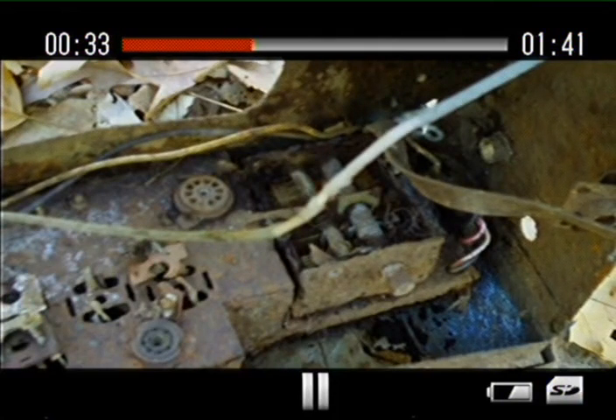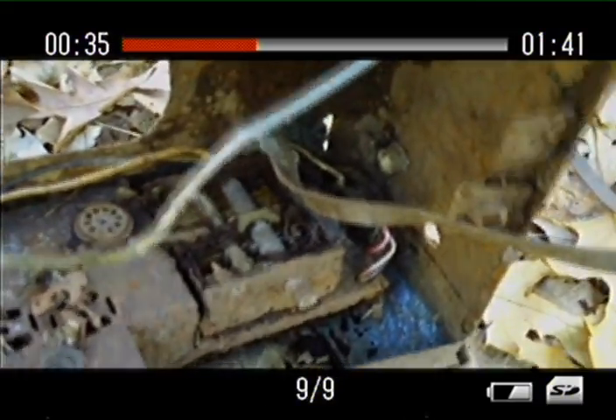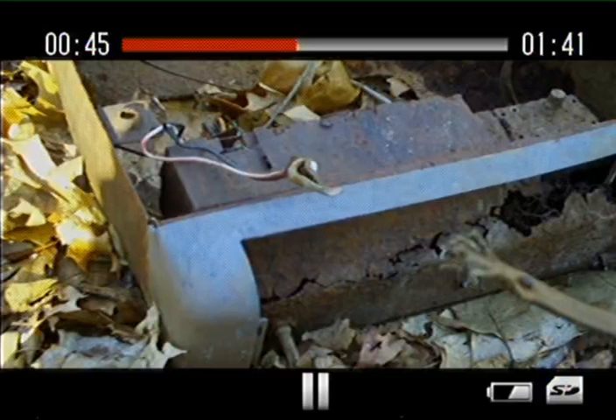The tuning capacitor, which you can barely even see there, is actually completely filled with dirt, and the dirt inside this radio was so dark it looks like topsoil, because it's been sitting there so long it's fully composted. You can see the tube sockets are the miniature type. That's the end of the antenna wire — it's regular 300-ohm twin lead, like you'd see for UHF TV. My guess is they didn't have coaxial cable for FM antennas back when this radio was built, so that's what they used.